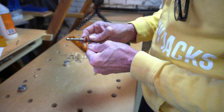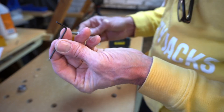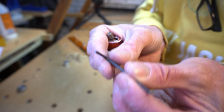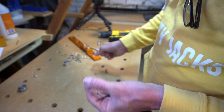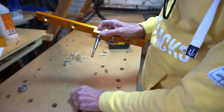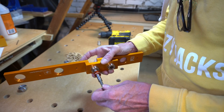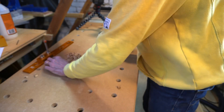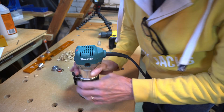I tightened it as tight as I needed so it didn't move, then spent five minutes trying to get it off and ended up having to find a brand new allen key from my bike tool set because the original had rounded out. I'm not using that depth stop in future. Once I got to that stage, the only other thing I did was get the router with a chamfer bit and just run around each hole — it gives your dogs a nice entry point.